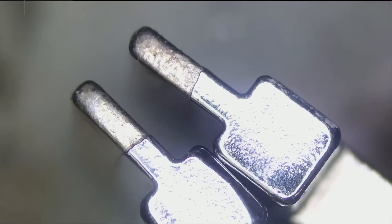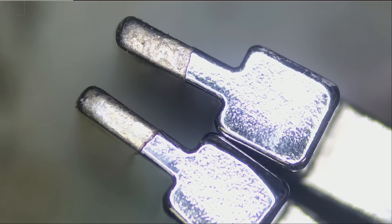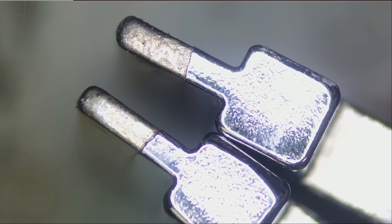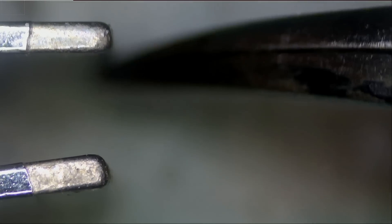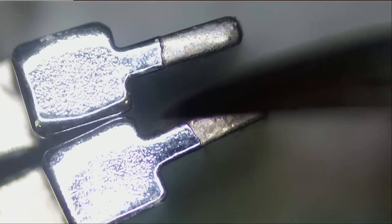Let's take a look at this tip under the microscope. Now if we close it, it doesn't close fully — and the reason they have this gap is so that when you grab a big component or IC with the tweezers, it's going to align vertically and not at an angle. That means more heat transfer onto that component, and that's what it's all about: heat transfer. If we grab a component by just the very tips, we lose a lot of heat transfer compared to using this whole surface.